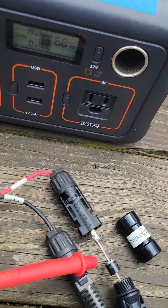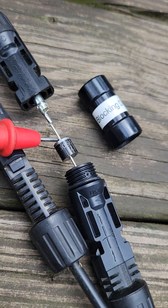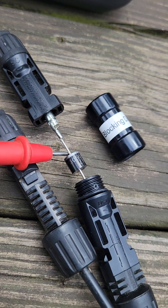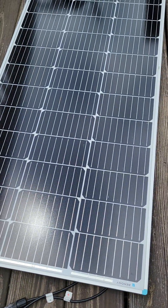But I can't imagine this little diode dissipating that much heat. At 30 amps at 0.7 volts, that would be something like 20 watts of heat — that would be crazy. But in this application, it's never going to see more than 5 amps maximum.